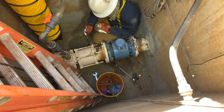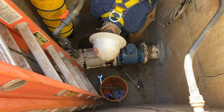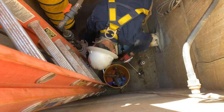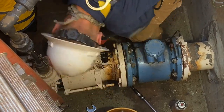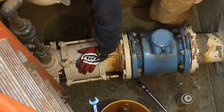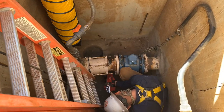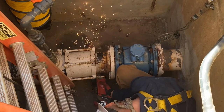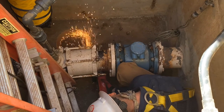Reno can be seen using a lubricant on the threads to remove the nuts from the bolts. This is done preceding the removal and replacement of a steel transition coupling. Transition couplings are often used due to differences in pipe alignment over time. This coupling creates a seal despite those differences, and allows for maneuverability when removing or inserting inline devices and unions on a pipeline. At this point it was determined that the threads and bolts were not able to be separated and needed to be cut — the timeliest solution to allow easy removal of the transition coupling to move forward with the job.